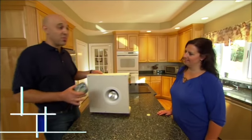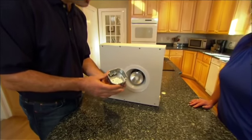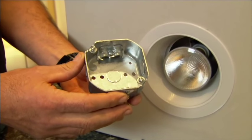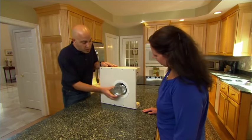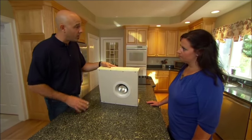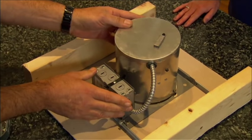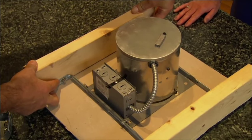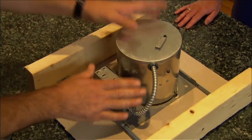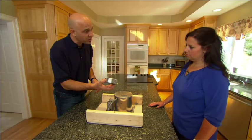You're right, Amy — this job is a little bit more difficult than hanging a standard light fixture. Let me show you why. I bought this light fixture box. Normally, this fixture box is in the ceiling and these two screws hold the light fixture itself. You can see the size difference — this is a four inch compared to a six inch hole that you would have in your ceiling. There's a lot going on above the ceiling that you don't see. We have a new work fixture box that gets mounted directly to the structure of your ceiling. We wire it in through this junction box and then they drywall over it. So to remove this, I would have to cut out these bars, remove that box, and tie it right into this new fixture — and you'd have a big hole.